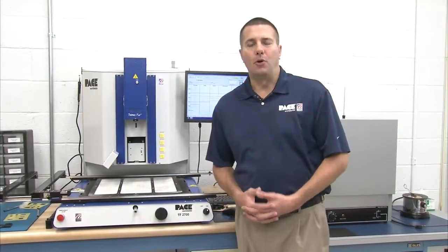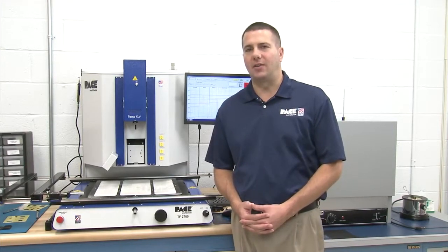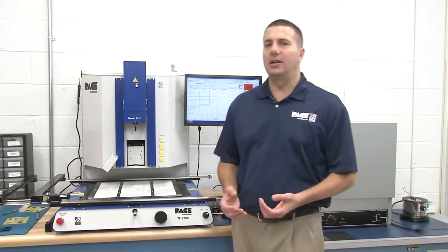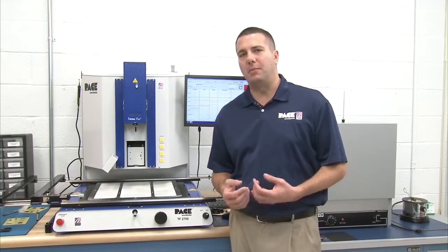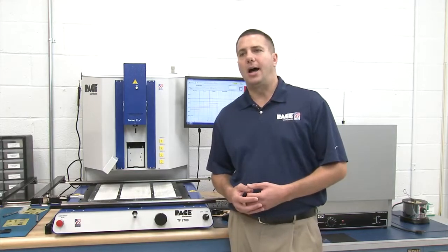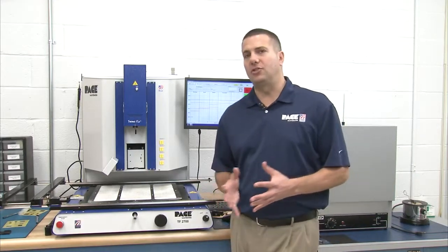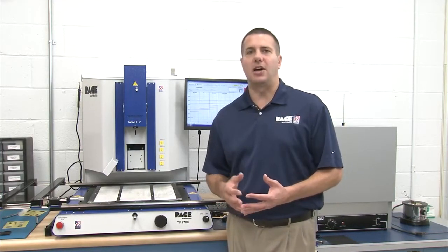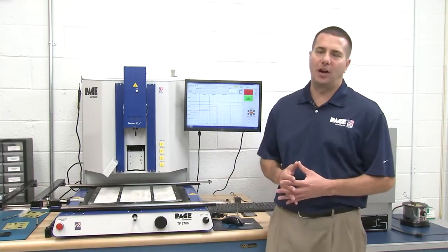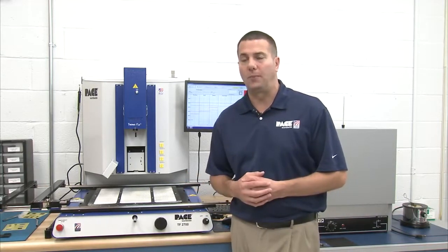So next, we're going to talk about thermal profiling. And the most critical part about a thermal profile is understanding what target temperatures you're trying to achieve throughout the cycle. Ideally, when able, you're trying to mimic the original manufacturing process of when that circuit board was initially built. Typically, when it's manufactured, the manufacturer would pay attention to the specifications of the components, the solder paste, and the circuit board, and that profile would be very accurate for your application. That's not always possible, though. Sometimes you don't have control of what you're trying to rework.